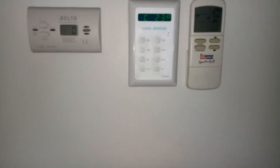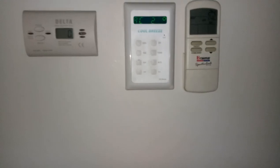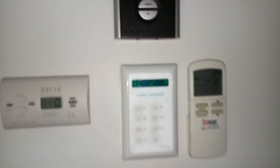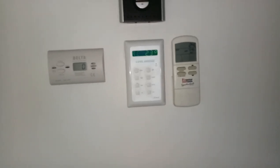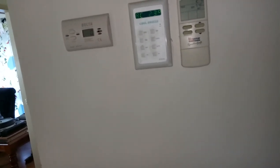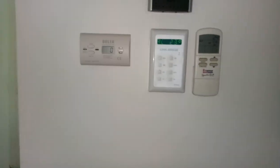Just a little lesson on evaporatives: I'm not a big fan of them and I'm actually going to upgrade to split systems in the house as time goes by. It's not recommended to leave these on 24/7 because the air gets very moist — we're sitting at 77% humidity now, and after a good week of use even on a hot day, everything like cardboard becomes moist and wet feeling, which is not good for you or the house. It's a good idea to turn them off every three days, let your house air out, run it on fan mode from outside air for three to four hours and let everything dry out, then switch it back on again. That is Matt from the Wicked GQ Patrol Channel, over and out.